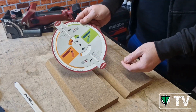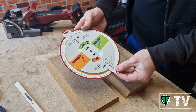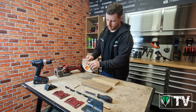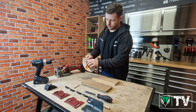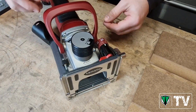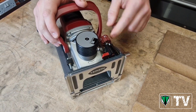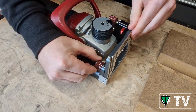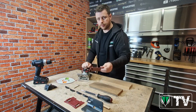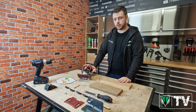First thing to do, grab your Lamello P system configurator wheel and find your finished angle, which in my case is 90 degrees. I'm using 19mm material, and my connection is going to look somewhat like that. We're going to use a P14 connector and we'll need to put the 4mm packer plate on the machine. So we'll turn the P system to 14, the plunge depth round to max, set our mitre fence over to 45, and put on the 4mm packer plate that comes with the machine in the box. That machine is then set up to go ahead.